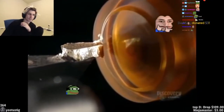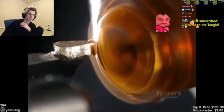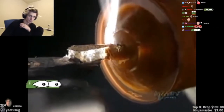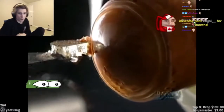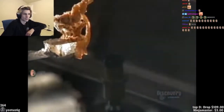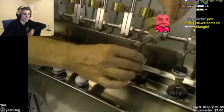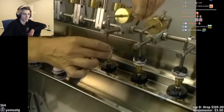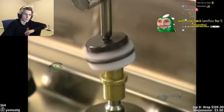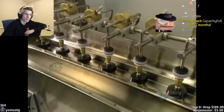The comfort of a lens is also determined by its thickness. It must be as thin as possible while retaining sufficient solidity. They begin by shaping the outer diameter of the lens, which takes only a few seconds. They now polish the outer surface of the lens. This polishing, done at high speed, calls for an abrasive paste, some oil, and a small polyester cotton ball. This apparatus polishes several lenses at the same time, a step that takes only 60 seconds.